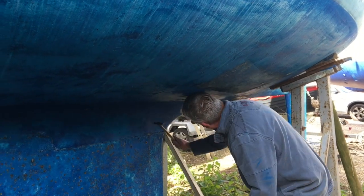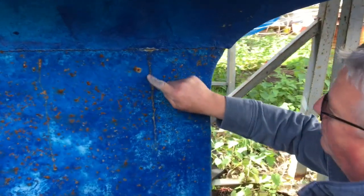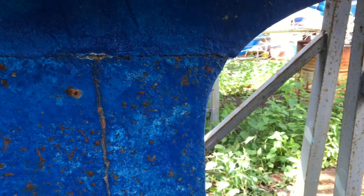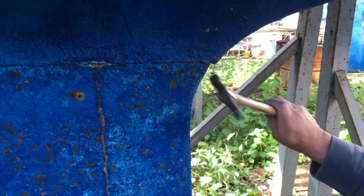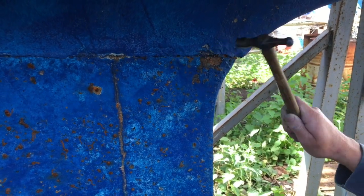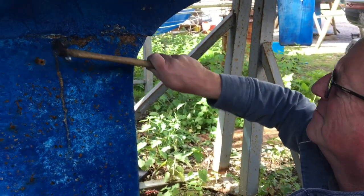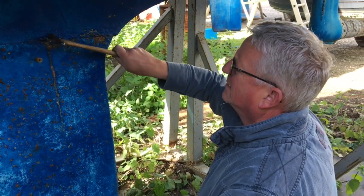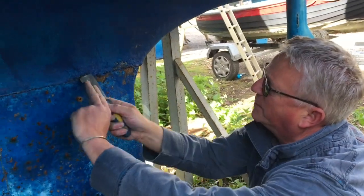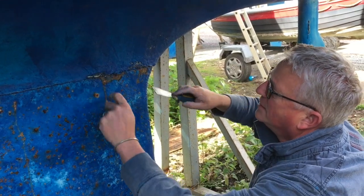Certainly you've got a lot of anti-foul hanging off of it. From the other side we've shown that you've got little telltales like this corrosion line down here, which would suggest there's a little issue going on. You can see the end of the keel is quite corroded. So I'm using the sharp end of the hammer now — you can hear there's a lot of mastic and stuff being chucked over that. What we've got there is actually quite a lot of mastic or something stuck in there, and you can actually just see back to the laminate.